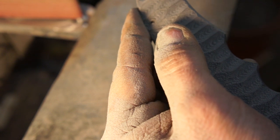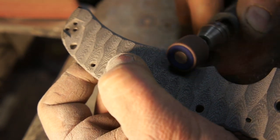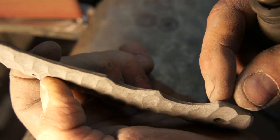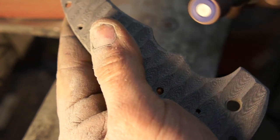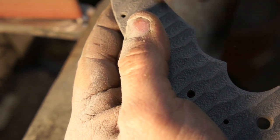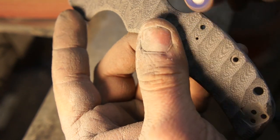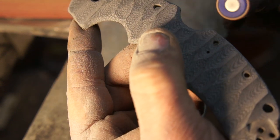I'm going to go a little deeper on the inside areas. I'm going to kind of scoop it in there, but don't go too far. If you hit right here too far it'll get really narrow, so you want to be careful there. In all corners like this where they intersect, it's easy to get super thin and ruin it. See how thin that is? Focus more on the middle, just touch it lightly, then dig in and touch it out.